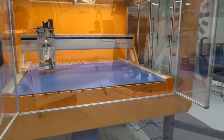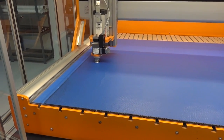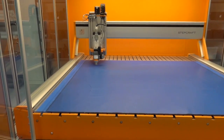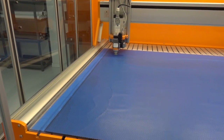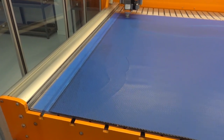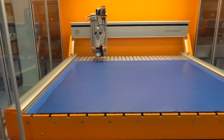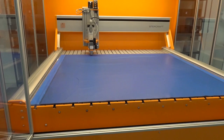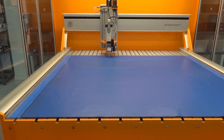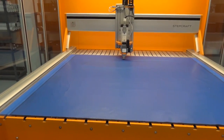Let's see a little bit more of how all of this works. This is where it begins at the CNC machine with the pre-preg carbon fibre — that has to be stored in the appropriate freezer and only has a certain amount of time before it's no longer usable. This cuts out over 500 shapes to make each individual wheel, for all the different layers and all the different elements. You can see these shapes that have been prepared and developed through various iterations to create the final result of the wheel. This process takes a short time to cut out the pieces, each of which then gets taken out, the excess material discarded, and then taken over to the wheels to be assembled.